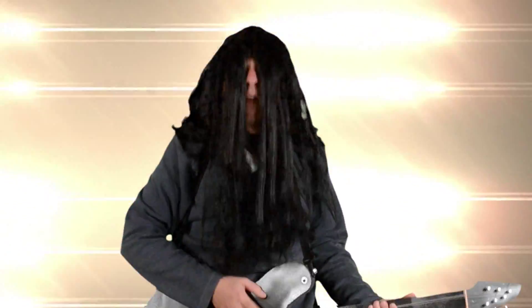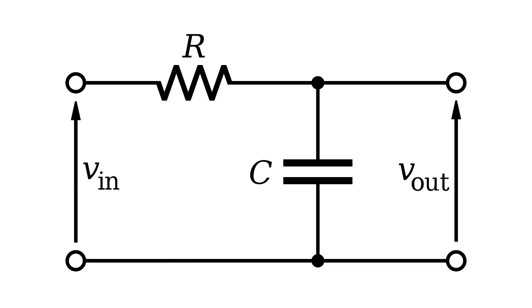Phew, that was a lot to cover. Got it all memorized? Nah, didn't think so. But to help you remember, here's a little segment we like to call Recap Time! A capacitor's job is to hold a charge. By inserting a resistor into the circuit, we limit the current and the capacitor takes longer to charge. The bigger the value of the resistor, the longer the capacitor takes to charge. This is the basis of a classic RC, or resistor-capacitor, timing circuit. And when building larger timing values, you may end up using an electrolytic capacitor, which is polarized — don't forget to wire it up in the proper direction, or you could have a nasty surprise.